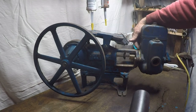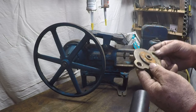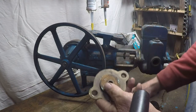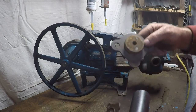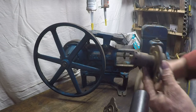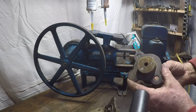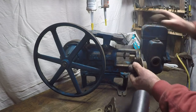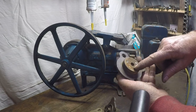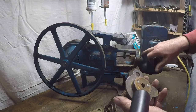Other things to look for is the gland. On this one here the gland is nice and shiny because I've cleaned it up — it's a brass gland. With brass glands you're going to get a couple of different types: ones that are flat at the back, ones that have an impression, and ones that poke right into this part here. These last ones are the hardest to remove and a lot of people break the wings trying. There are often battle scars on these from people damaging them. The best approach is to take the whole head off, take the shaft out, then use something large that won't foul the hole and hammer it out from the other side. It's the rust in there that clamps it on.